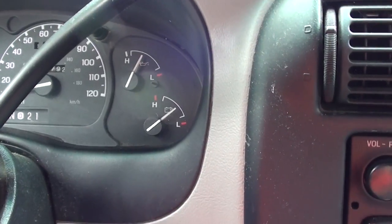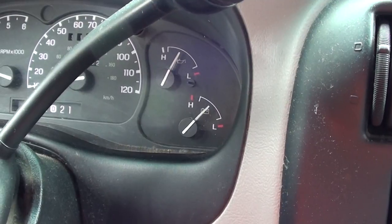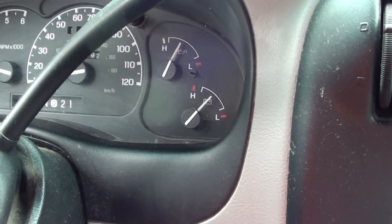Let's get in the cab and turn on the engine. You're going to see the needles go up — the oil gauge is past 12 o'clock, around the one o'clock area, and the charging system gauge on the bottom right is right in the middle of the battery range. What you're seeing now is what you're supposed to have. It's not supposed to move. If it doesn't look like this, you have a problem. After replacing just about everything, the fix was simply getting the ground correctly connected.